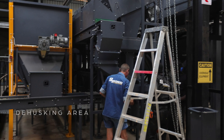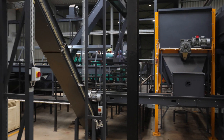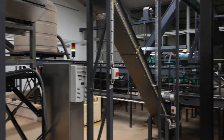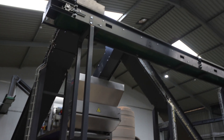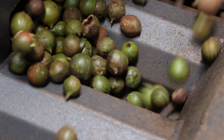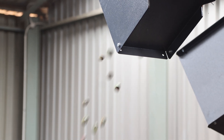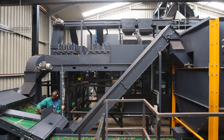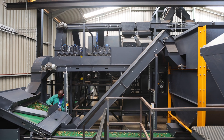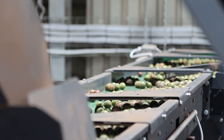This is Dan Rock's dehusking area. In this area we've got two clean nut and husk hoppers, also 16 tonne. Those hoppers feed into rubber dehuskers — we have a bank of six of them which each do 500 kg of nut and shell per hour. Next to that we've got two conventional dehuskers with pneumatics on them. All the product of nut, shell, and husk feeds into a husk blower which removes husk and lets some nuts with extra husk pass through.